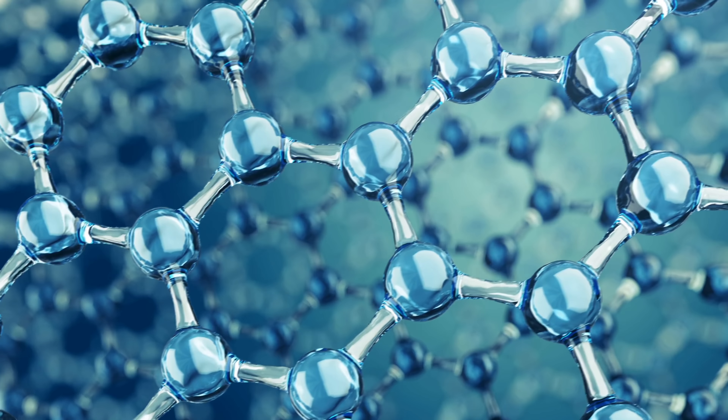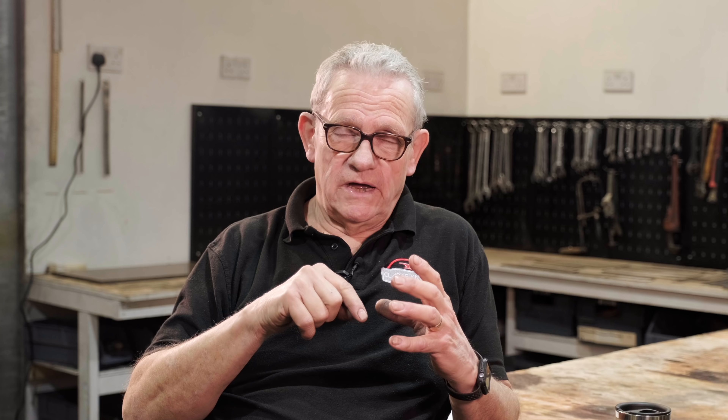You've got this piece of metal with stresses in it. How do you get those stresses out? You put it through a stress relieving cycle — into a furnace, heating up to below the critical point. Your steel has a crystal structure: little atoms made into crystals. The crystals in iron are cubes — eight little atoms sitting on the corners of a little box making a cube. At room temperature, iron has another atom in the middle of that crystal — it's called body-centred cubic.